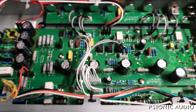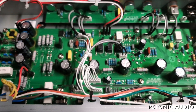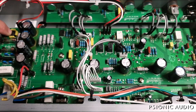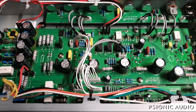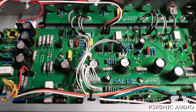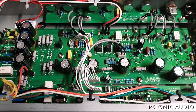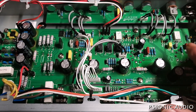This amp does variable voltage power scaling in a rather unusual way. The HT comes in from the rectifier here and goes to a first filter stage cap. After that, it goes through R7 to another filter cap, and that's what feeds the center tap of the output transformer. From there, in one branching, it goes to a screen node which is unused except for additional filtering, and then goes to a very traditional ladder of filtering for the preamp stuff.